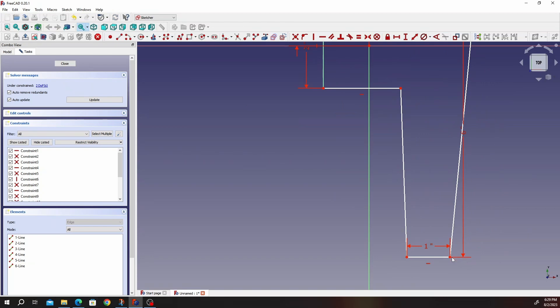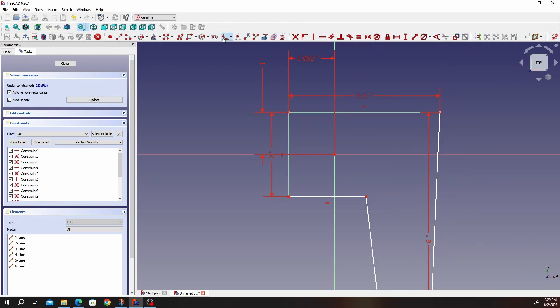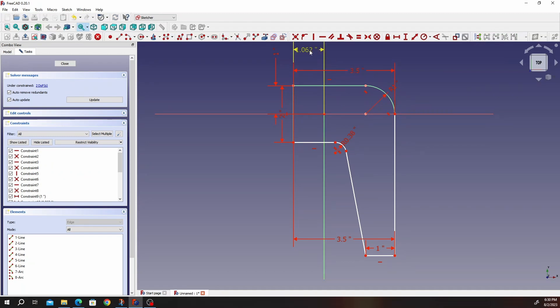So we are starting to have some idea of how this is coming out. Go ahead and click on the fillet tool — click on that, and that, and that, and that and that. Select radius: that will be one inch, and this will be 0.380. Click on that tool and give this 3.5. The same will be that and this — go ahead and give it 3.5. Let's just put that there so you can see it.